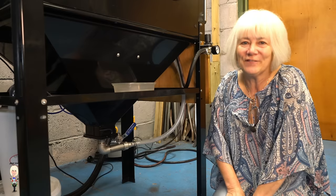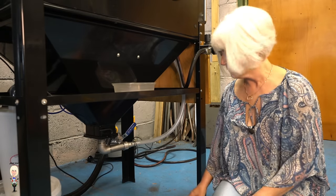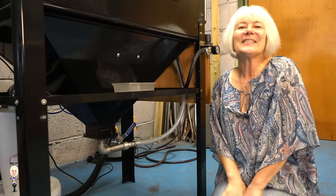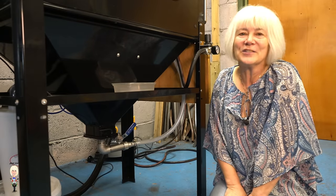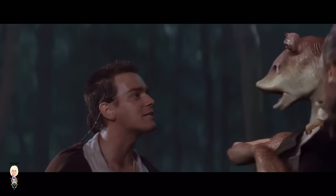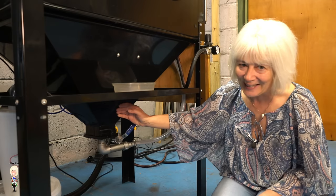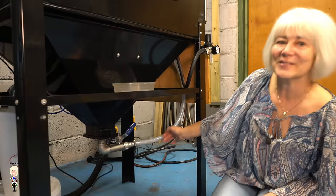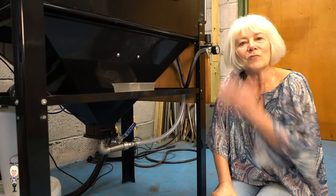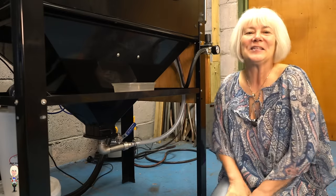Finally I made this — it's called a metering valve. Let me start by explaining why I did it, then what it does. The tank comes with a pickup tube: the idea is that you bury it in the grit at the bottom of the tank, connect it to the gun, then when the trigger is pulled and the air passes through it sucks the grit up the pipe and blasts it out. What this metering valve does is allows the grit to collect at the bottom of the tank and get sucked back up along this hose and onto the gun. This valve allows me to add air to the line so that the grit is already aerated when it gets there and will flow easier up the hose. This is one of the things I will be playing with to get my settings right.